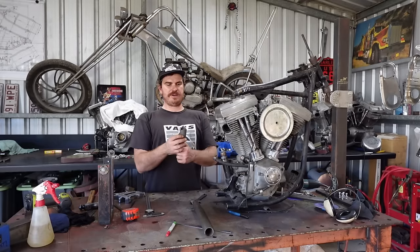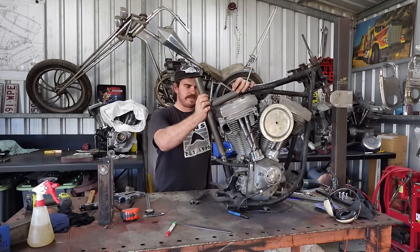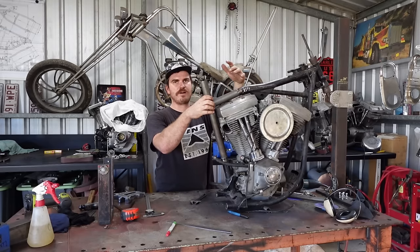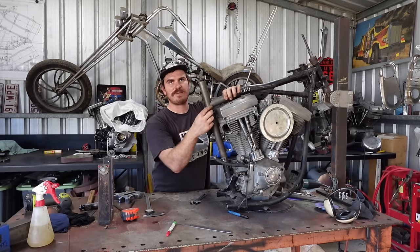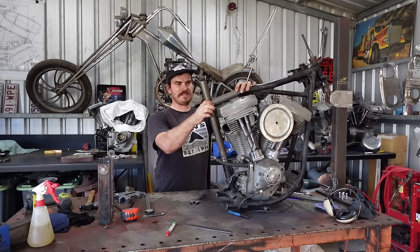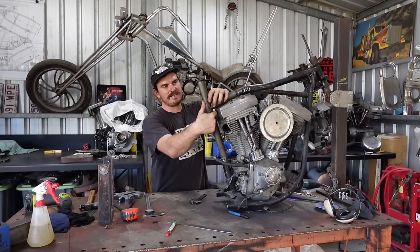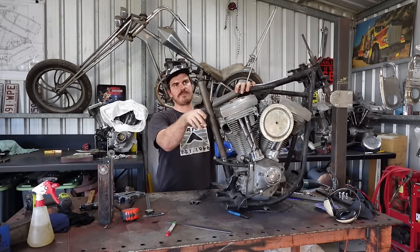Alright, let's see how I did. I cut it at a few degrees under 90, make sure you've got it around the right way. That guy lives there like that. The beauty of doing it this way is I can move this as much as I want and then just tack it where I want it. Don't beat yourself up if your gap here isn't perfect — at the end of the day you're welding it up. With a MIG you could probably fill 10mm, with a TIG like I'm doing it's only a few mil. I'm going to set this up with a few magnets, a little stop in between the engine, so I have my desired fit, and then I'll weld it up.